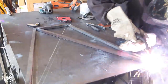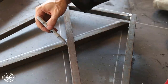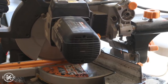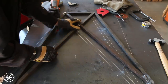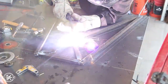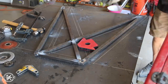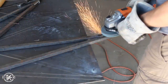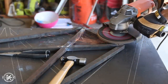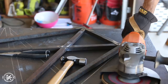The second crossbar is a little tricky since it needs to be cut in half. I raised up the assembly, positioned the bar underneath, and marked it for the cuts. Both angles are the same so I set it up on the cold saw and quickly made the cuts. The fit was decent, and I tacked the pieces in place then ran full welds on both sides. I did have a little mismatch at the miter on the bottom, but the nice thing about metal is I could just fill the gap with filler metal and grind everything clean afterwards. After using the 4.5-inch grinder, I changed over to the 7-inch grinder — that thing is a beast. If you weld sloppy like me, do yourself a favor and get a big grinder; it works twice as fast and really hogs off the metal.